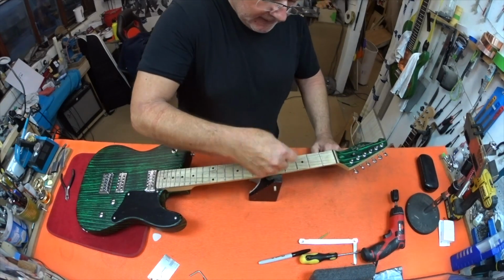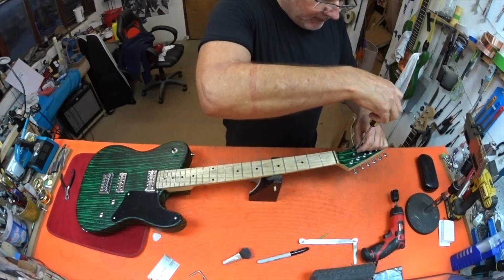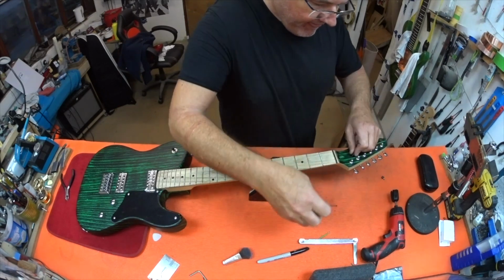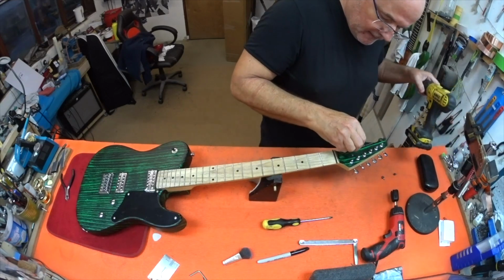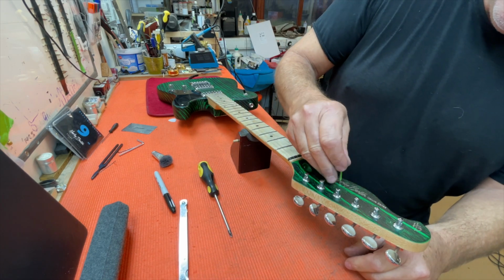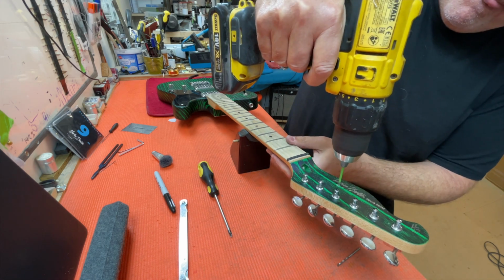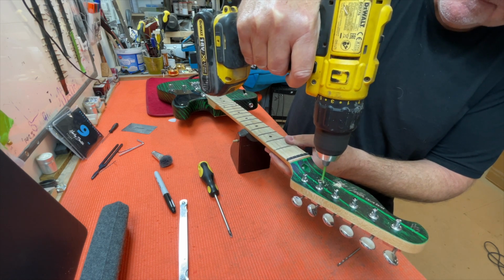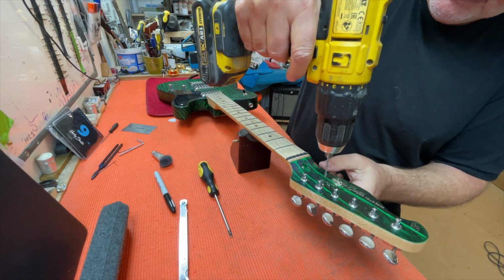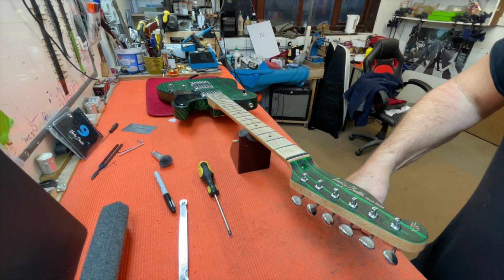Okay, so I'm just going to clean up the dust. I'm going to drill a little bit further in with this widening screw because they're a little bit tight still. Also, I'm noticing that I think it's not wide enough. I think I've wimped out on the width here. I think I need this to go down to the correct depth first, which it doesn't, and then I need to widen the top part second. Guides are most crucial. So a bit wider at the top, and that allows us to go all the way in, but stops us splitting the wood or risking splitting the wood. Okay.